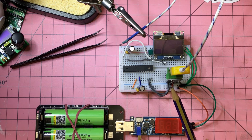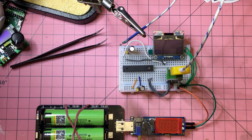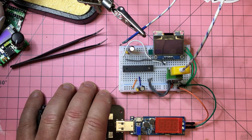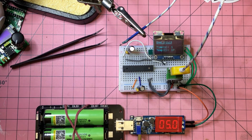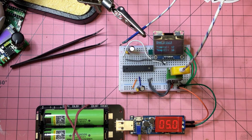The ATmega 328P is fed five volts, along with the MAX6675 module, and there's the thermocouple - currently reading around 16 degrees. I've also got the time ticking away here. The plan is to put this thermocouple inside the oven, turn it on, and see what happens in terms of the actual temperature profile: how fast it heats up, whether that depends on what setting it's on, and so on.